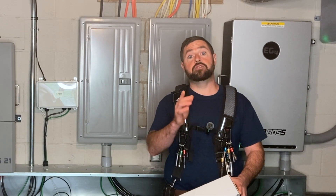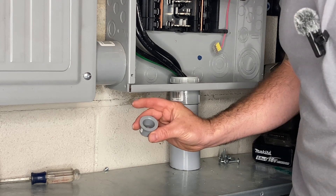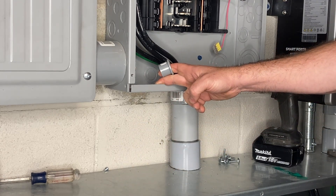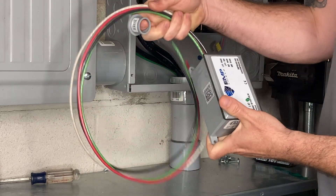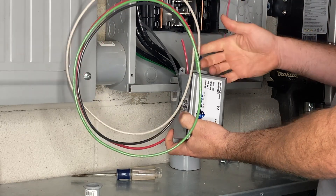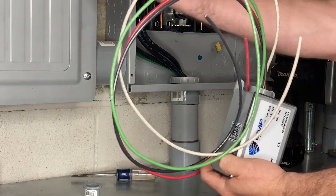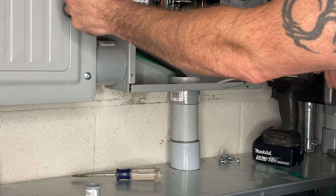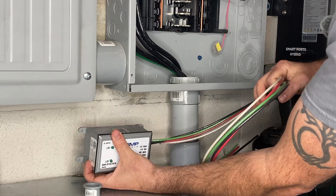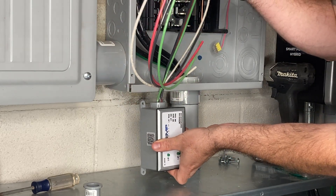If you're getting value out of today's content, hit that like button, subscribe, press the notification bell, or leave a comment down below. For installation, I'm going to use a PVC reducer bushing — it'll work similar to a box adapter. I'm not going to glue it in since this is inside and I want to be able to easily remove it in the future. A few things to note: you want to avoid sharp bends in the wire as much as possible and minimize the length of the conductors. I don't have room to punch it right through the side of the panel, which would be ideal. I'm going to bring it straight through the bottom and mount it kind of on its side.